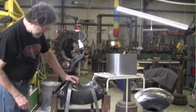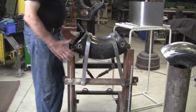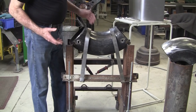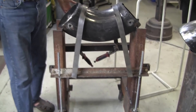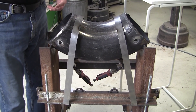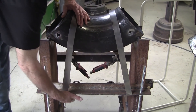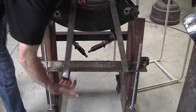Those were a waste of time. Then I tried blasting some holes and putting threaded rod with a couple of boards across, but that didn't work so well either. I said I need straps, I need adjustability. So I came up with this idea: these are just sheared strips of sheet metal. It doesn't matter if you get them hot — they're sacrificial, no problem, you can keep making them as you need them. I clamp them onto this adjustable angle iron so we can tighten it right up.